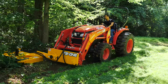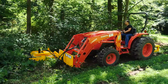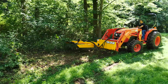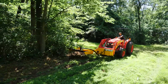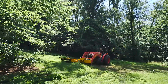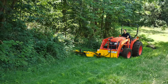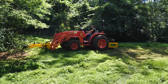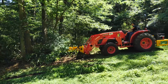One thing you want to be conscious of when using this is not pushing it too hard down onto the ground — it doesn't float real well. Generally when I'm running this, I'm hovering the thing off the ground a little bit. The arm there will allow it to pick up; if you have it in the fixed position, it won't move like that. It's just going to work a little bit better if you are kind of floating it with your loader. It is quiet, I'll give you that — you flip it on, it spins up, and I can't even tell it's running. No driveline chatter or any of that kind of stuff at all. In this offset position, I can see what I'm doing, which is pretty neat — if it was straight out in front of the machine, I wouldn't have as good a view of the mower as I do off the side.